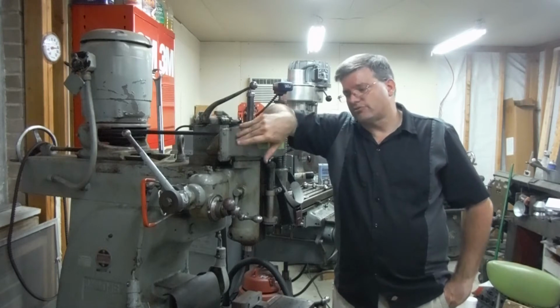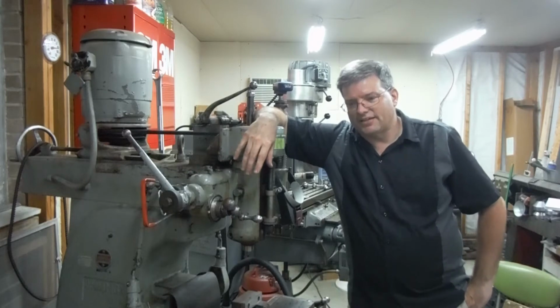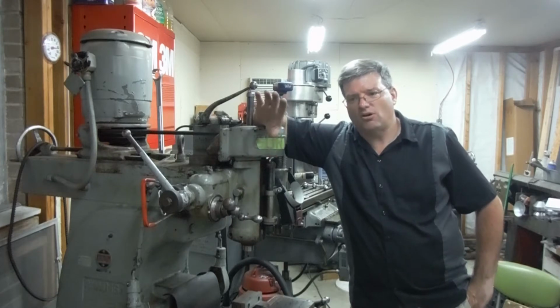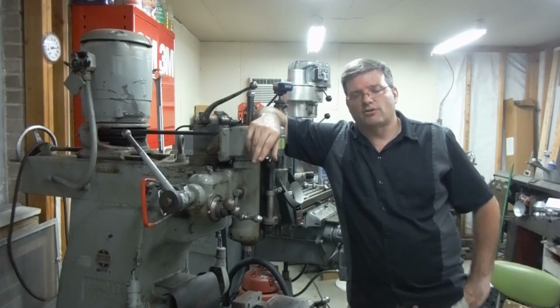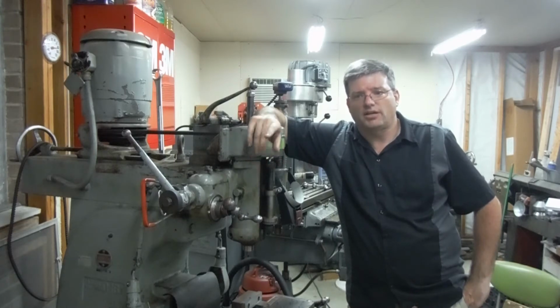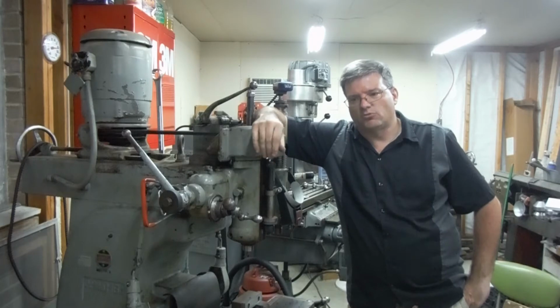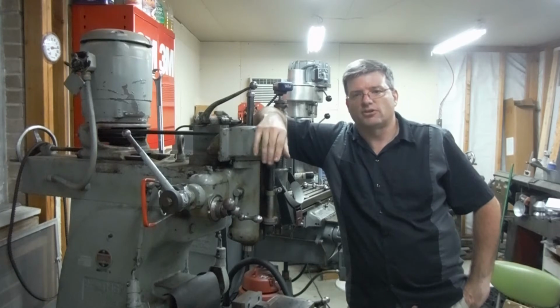So we came over here, we set it up on the Gorton, the 016A super speed mill, and got things going. Did a pretty good job, but we were a little pressed for time, so I didn't have a whole lot of time to bring out the camera and really shoot some video of it. I did get a couple of the larger passes in with the large inch and a half radius cutter for a router, and then a 1-inch radius cutter for a barrel channel. We did have to go in and inlet just a wood blank to be able to accept the recoil lug and the action itself, as well as the barrel channel.